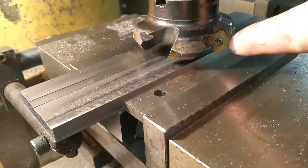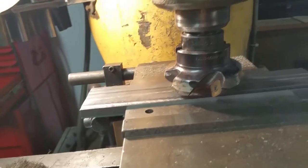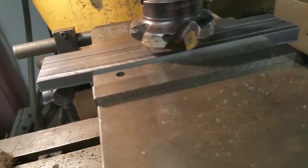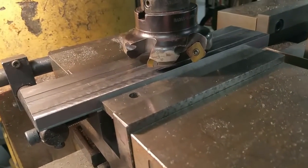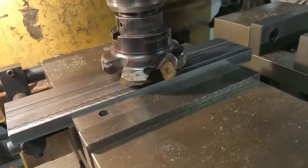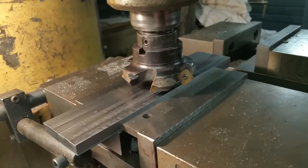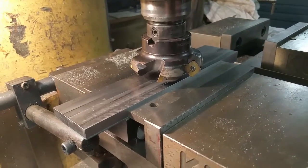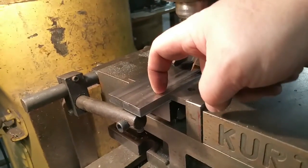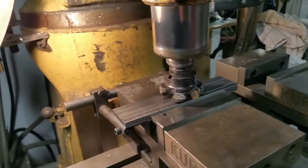I've got a cutter in here right now. If you look at this insert real closely, that's the same insert that the Tormach Superfly uses. This is a Sandvik cutter, it's an R290 - now RA245 - and it's a high-shear 2.3 or 2.5 inch cutter with five inserts. It's designed primarily for low horsepower machines like a Bridgeport, and it works real well. So I'm going to use that like a fly cutter and bring this surface down to the approximate thickness that I need.